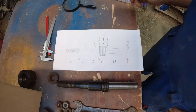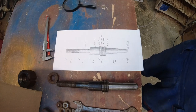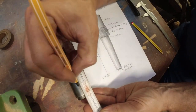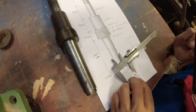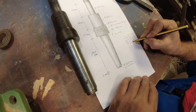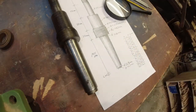Some old taper standards are still in use, such as the so-called Morse tapers, named after their inventor, the mechanical engineer Stephen Morse. I measured the cone diameter in 10 mm increments and determined the cone pitch very accurately using linear regression. Finally, it was clear that this is a so-called MK4 — a Morse taper number 4 — corresponding to the standard at the time.